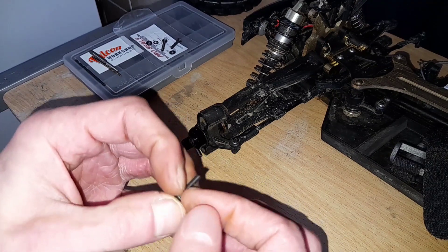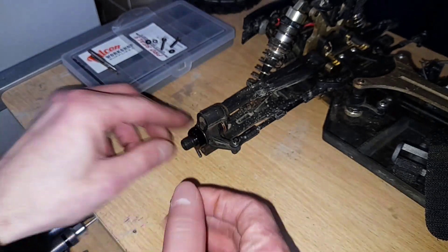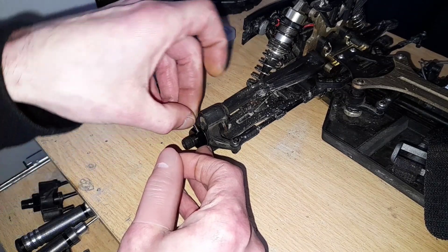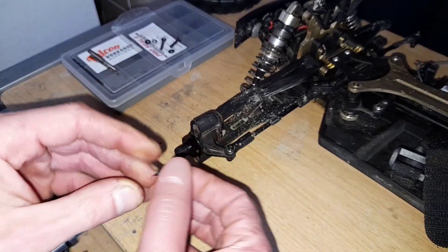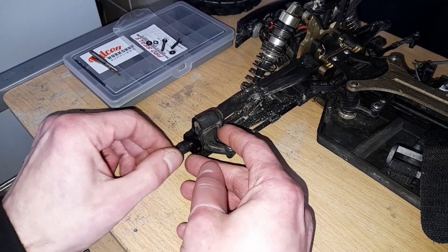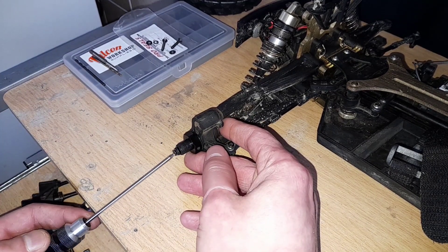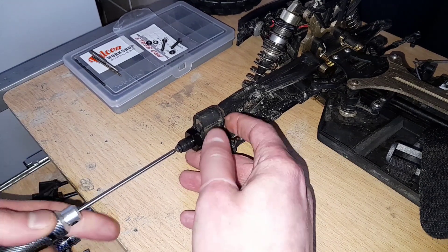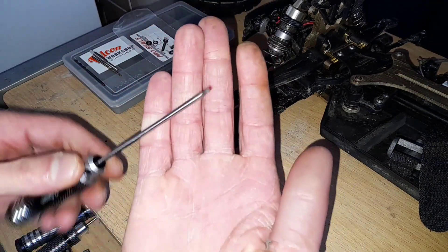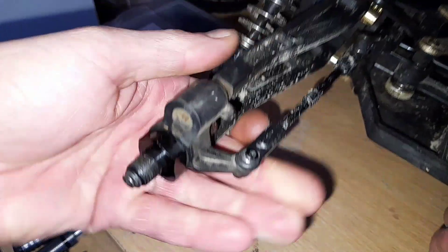So I cleared the hole. Knowing that it was an M3 but being so small, I thought to myself I'd replace it with a larger screw. Believe it or not, it just screwed in absolutely perfectly, all the way in. Once it cleared the cavity of the pin, it didn't damage the thread in any way. I could replace it with that, but there was still a gap — and I wasn't too happy with the gap, it looked absolutely hideous.